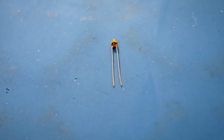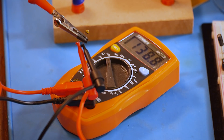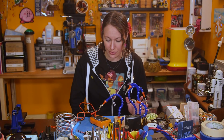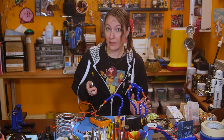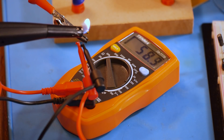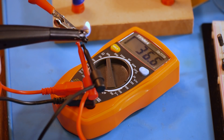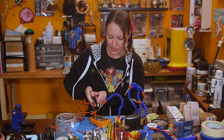I'm using a 100 kiloohm thermistor. Rather than just relying on the datasheet, I can physically check to see how much the thermistor resistance value changes in response to temperature. I hook the thermistor up to my multimeter and see its value — at room temperature it's almost 140 kiloohms. If I heat the thermistor up with a lighter, you can see the resistance drop to about 50 to 60 kiloohms, sometimes even lower. I almost got that down to 10 kiloohms.